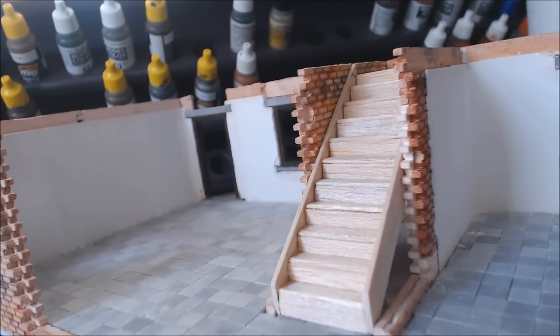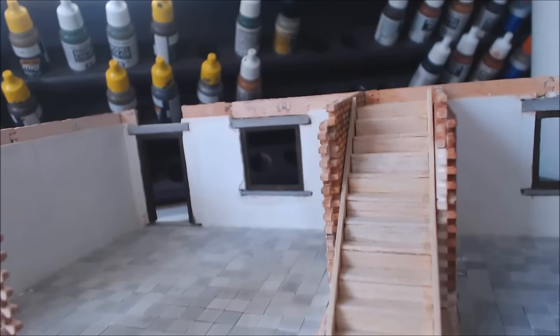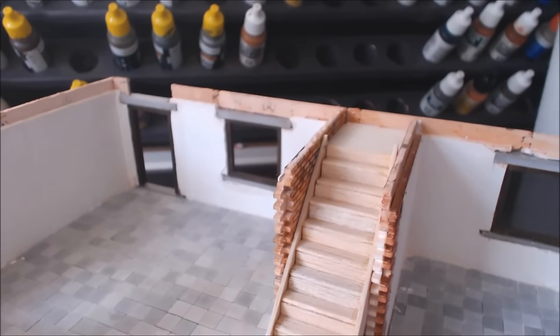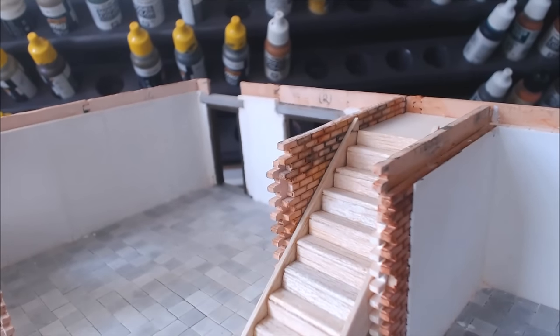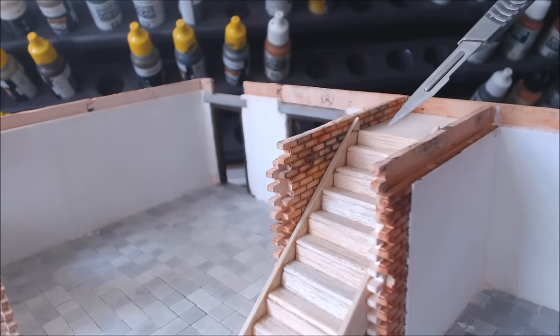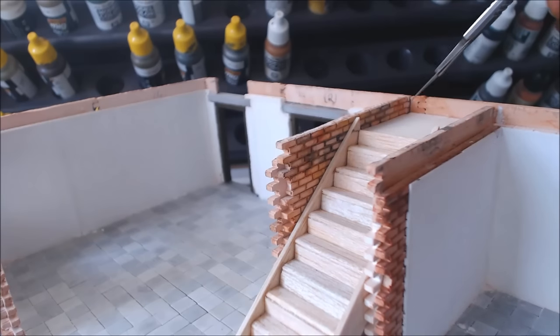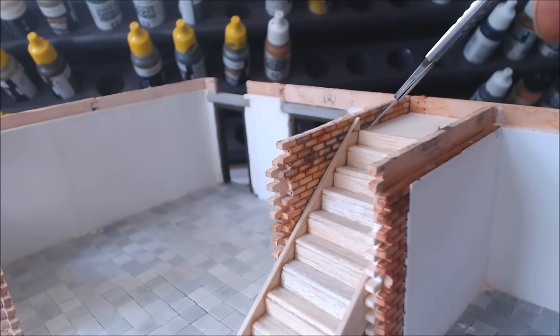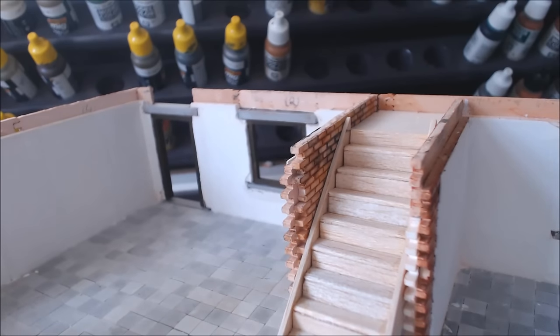I've breached the top and they don't look too bad. Now we've got to the top and the last riser comes level with my landing. The next thing I'm going to do is glue this landing in to the same level as that riser, and then we're going to put floorboards on here to make up the difference. I'll put you on pause, get this bit glued in, and then come back.